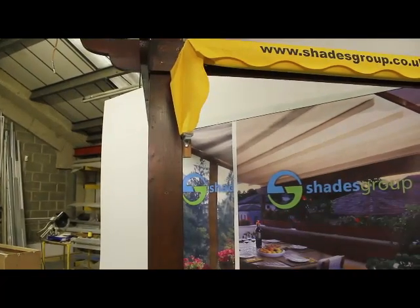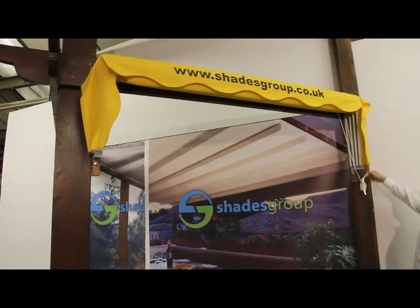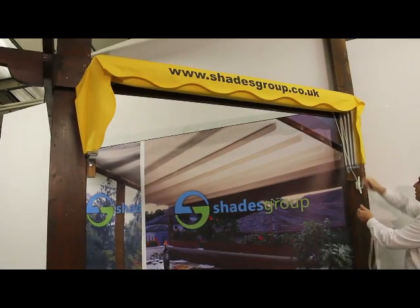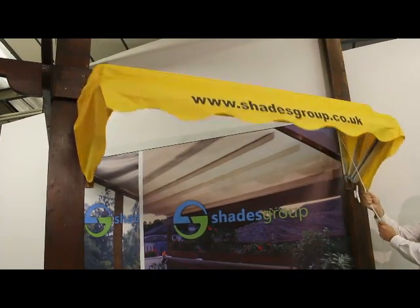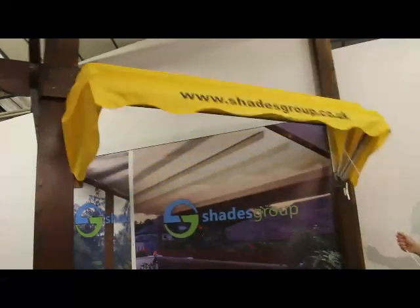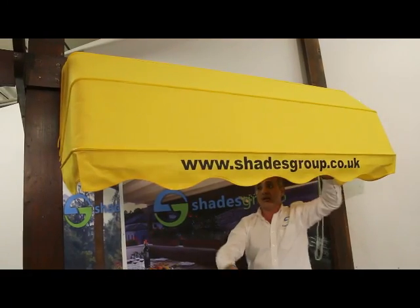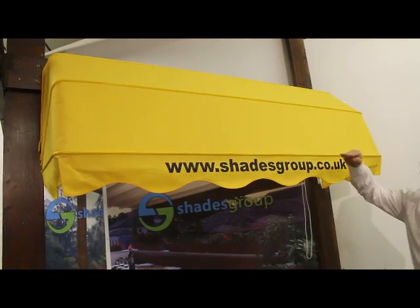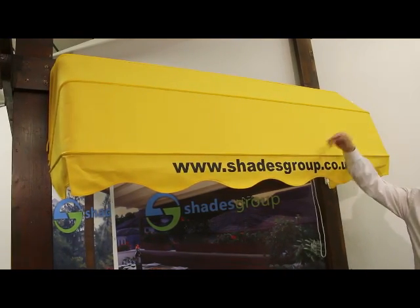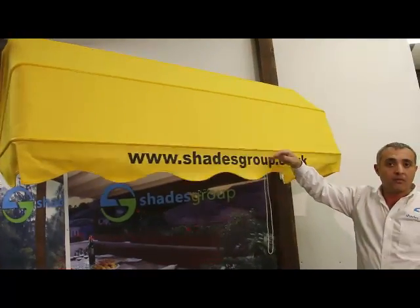Check the canopy 2-3 times and explain to the customer that you need to hold the cord and slowly open it. Make sure that the blind is open, closed, the bracket is fitted very well, and the fabric is straight. Once you're happy with that, keep in mind that the height has to remain 2,100 as a minimum from ground.